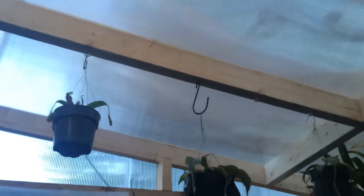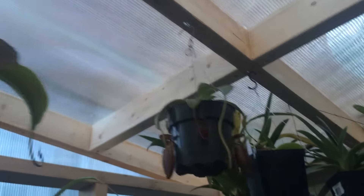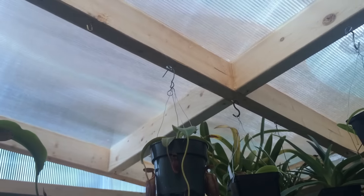What I'm showing you here is you can see the two-by-fours on the frame. What I've done — and this insulation is already in place — is window film stretched across between the two-by-fours over all of the roof. This creates a big layer of air as thick as the two-by-fours between the film and the polycarbonate. You take a hair dryer to it to tighten it up. That last panel isn't quite tight yet — you can see in the corners it needs a little work.